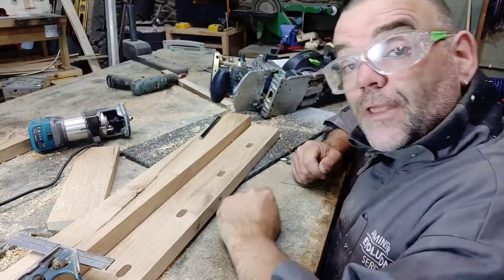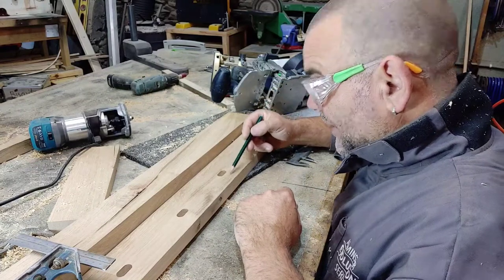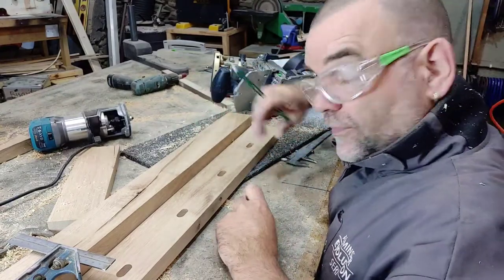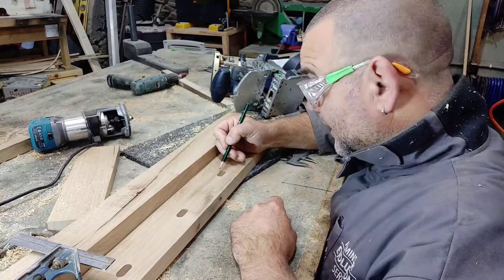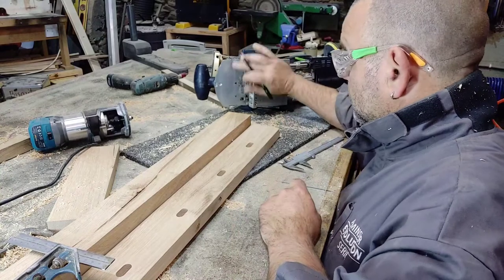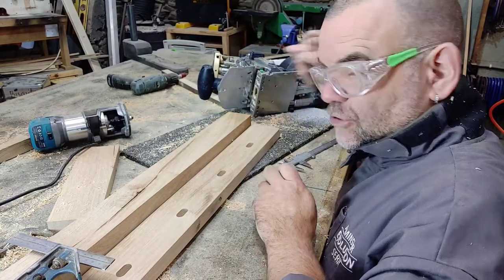The thing is, I haven't got one and I'm not going to order one because I might not need it again right now. So what I'm going to do is transfer these mortises to create new mortises in this handrail — it's a square profile at the moment but will be a handrail profile once I'm done. I thought I've got to try and eyeball the centre of each one and then transfer onto this handrail, so I can use the centre marker of the Festool Domino DF 700.